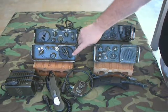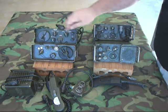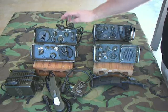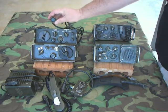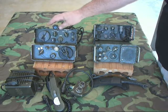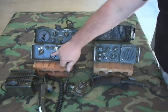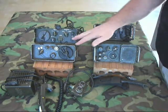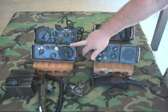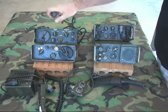This is it. This is the remote unit right here, local unit on top. Basically you connect the field wire here and here. It could run about two miles to remote a radio. It used one of these U-77 connectors, which was the big connector at the time for all the radios. And it used an H-39 handset, like this right here, that plugged in. Connected a handset here and a handset here. This was in your command post or the area where you wanted the remote from, and this was actually at the radio itself — the connector that connected onto the radio.